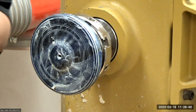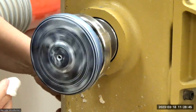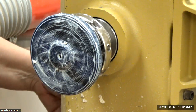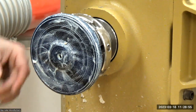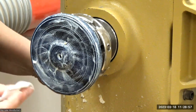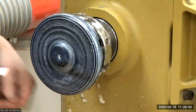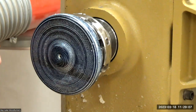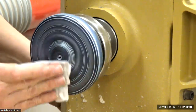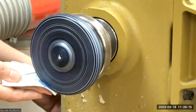And then, like I said, I usually use just a rag. Again, this is Jeff talking, the walnut log. You said not to paint it because it'll disintegrate on the surface. On the texturizing it will. But I could apply this with it for sure. You can apply it, but when you wipe it off, you want to use a rag. You don't want to go hog wild because again, you're losing your blue on here. So just light wipes, pulling it off.